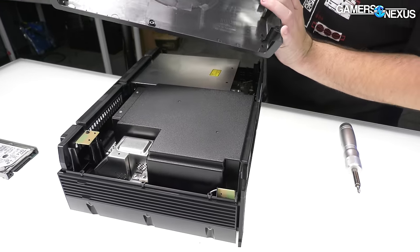This video is approaching about two hours of recording time — we'll cut it down a lot. There's the actual APU. It says Sony's name on it. The model number is CXD90044GC. Die size externally at the diffusion barrier is approximately 23.0mm by 14.9mm.